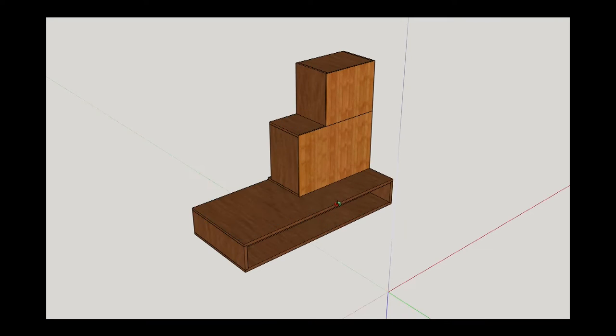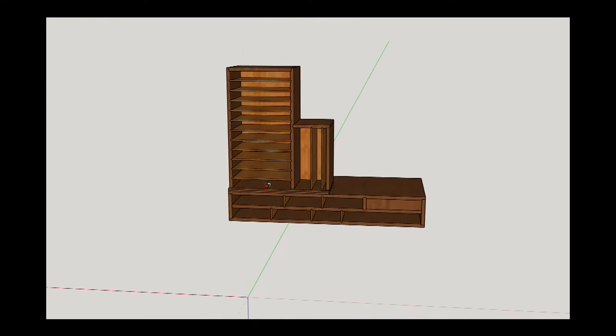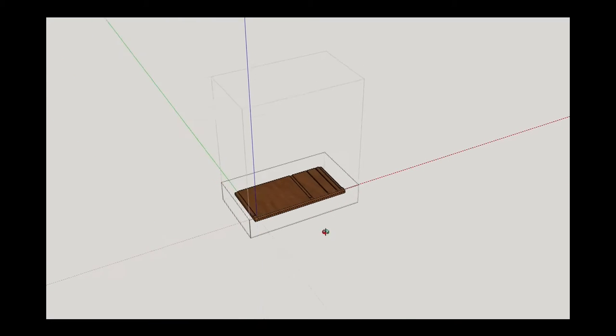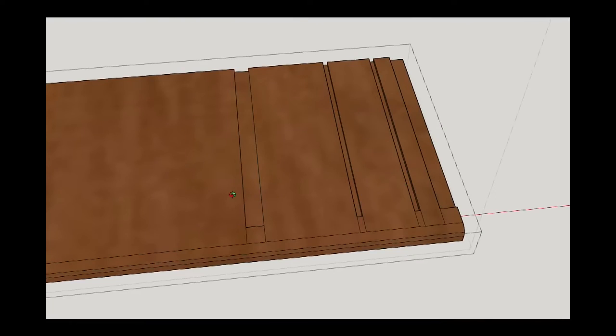And the MDF and plywood come in large sheets. So I'll have to lay out these parts and obviously cut them up oversize and then trim them down to size. I can foresee a couple of challenges, I guess you'd call it. The first challenge I'm going to have to come up with is on this part here. These grooves don't go all the way through. They actually have to stop 30 millimeters from the edge. So I'm going to be routing up to about here and then I'll just square it off with a chisel. So that hopefully won't be too difficult.